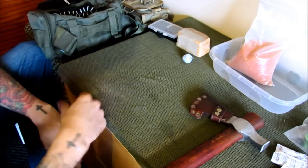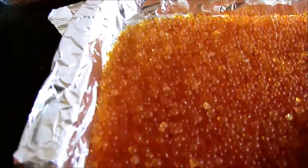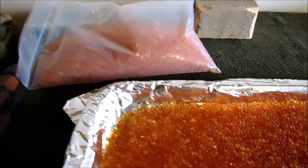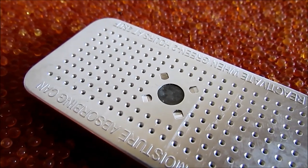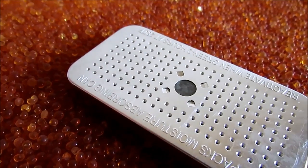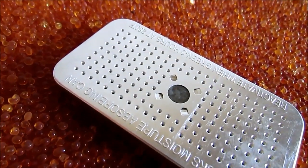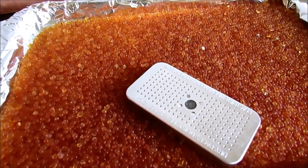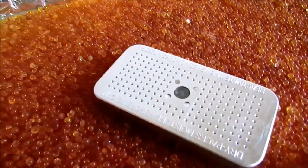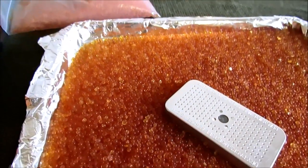I'll have to wait another half an hour and then get my desiccant out of the oven. So we've had an hour and, as you can see, the stuff that I've bought has turned really bright again, just like the stuff you get new. But you can tell from here that's still green — and that's the fourth time I've reactivated this. It's probably used up as much as it's going to do. I think that's probably shot now. About four reactivations and you've had it with one of them. This other one has been used a minimum of ten times — I bet that's about the twelfth time I've reactivated that and it's been perfect.